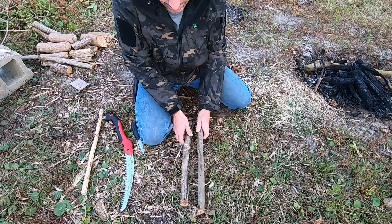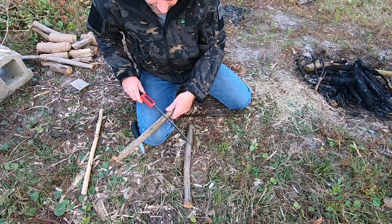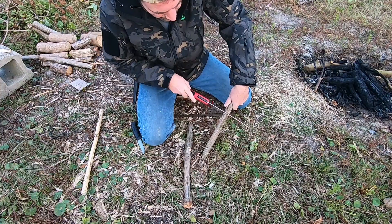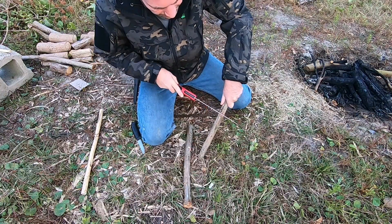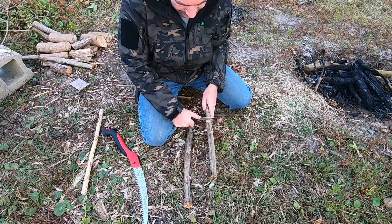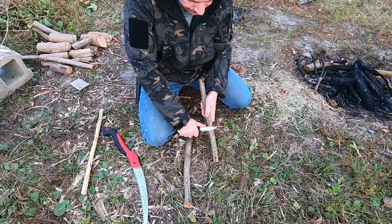Now the next best thing — let's go ahead and match it up. Make sure that it's correct so it's all nice and level. Don't ever cut on your leg, guys — always pull your material away. Those are the main cuts on the outside for a crossmember. If you do a couple more cuts on the inside, it makes it easier to remove that material. Take your knife and just pop it right out — just like that. Then you can dress it off.